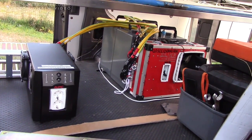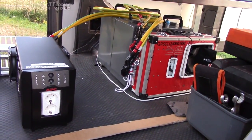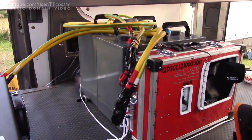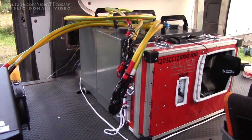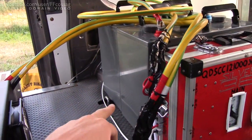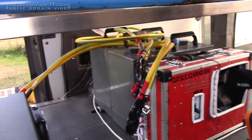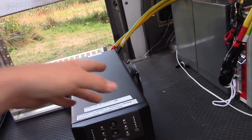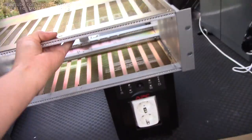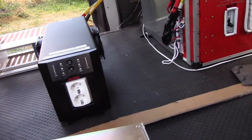Here's all the stuff loaded up into the vehicle with a bit of a mock-up of the high current wiring. I've obviously got the batteries and the connector box sitting right there. I'm probably just going to pull a strap around all this stuff to keep it together and a strap across it in that little attachment there. And I'm going to have the inverter sitting here, because I can just use it as a support for one of these storage boxes. I'll get a pretty good use of the space.